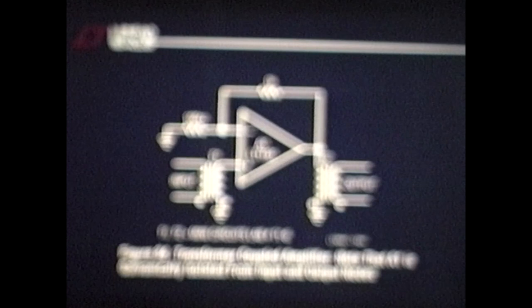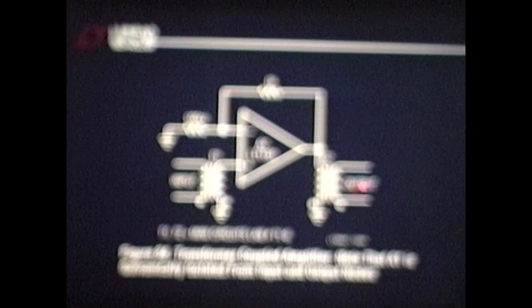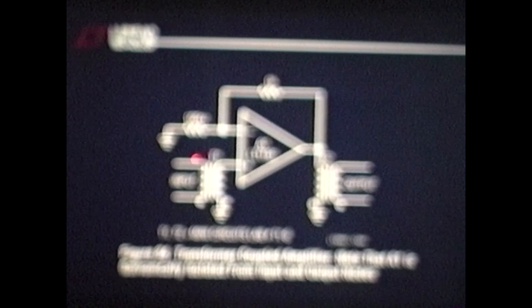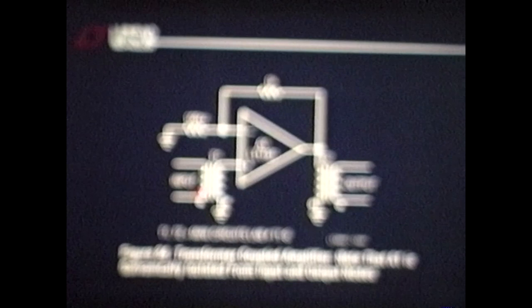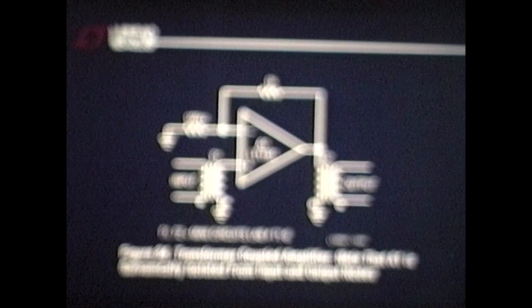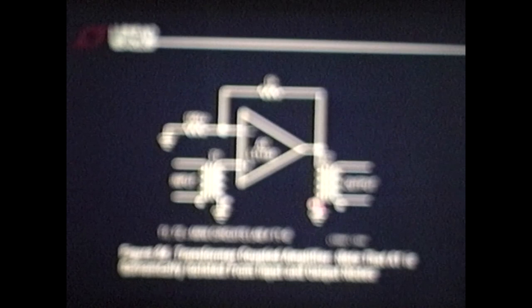If you've got good CMRR in the amplifier and the line is reasonably well balanced, you take a gain of ten with no sign of the noise despite being a hundred-to-one down on signal. Here's another way to do it: differential in. This circuit has one very magic feature — it will really take out ground loop effects, because there's no ground; the input and the output are fully transformer-coupled and fully floating. It's relatively expensive and large — two pieces of magnetics — but you don't have to use a differential amplifier; you can use a single-ended op-amp because the differential end is taken care of by the transformer, giving you better CMRR.